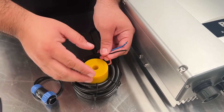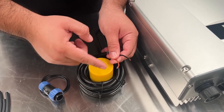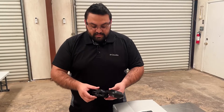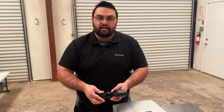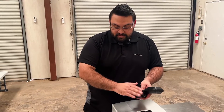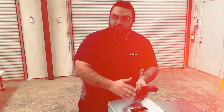Now the system is open circuit, so we're going to only use the black and brown wires and completely omit the blue. Generally, these float switches send power to and from the pump and cut it off when the float is activated. But in our case, we are only using it as a sensor signal and it's going to tell the controller to shut the pump off — no electricity flowing through.